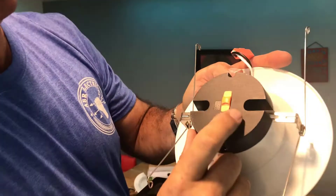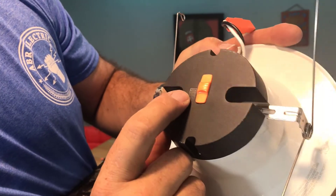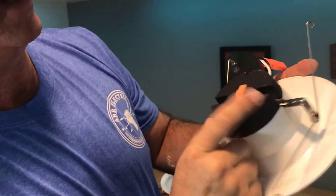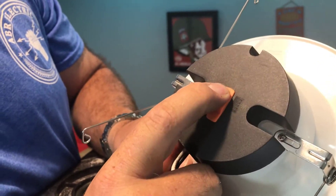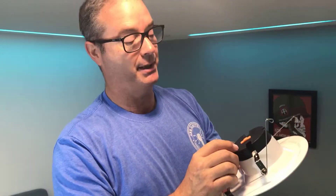This is one of the trims we use in our company — you can find something like this at Amazon or box stores. There's a little lever on the back, and depending on the angle you set it, it adjusts the color temperature from 2,700K on top, which is super warm and yellow, all the way down to 5,000K, which is super white, almost blue. I'm setting it to 5,000K because in this classroom I want crisper light.